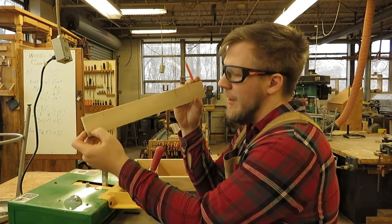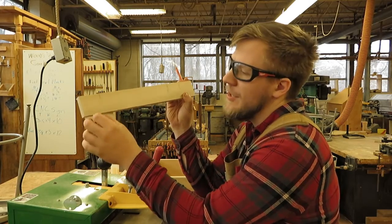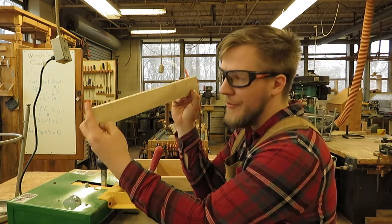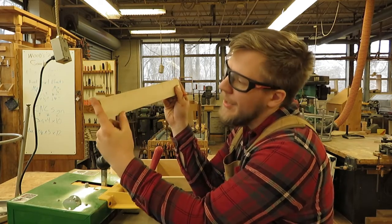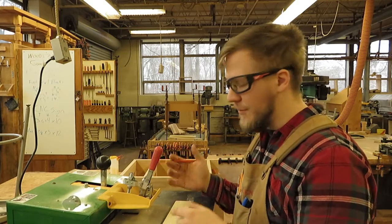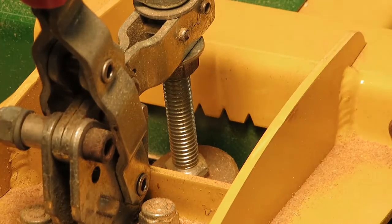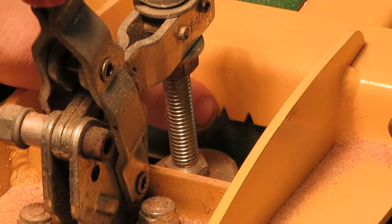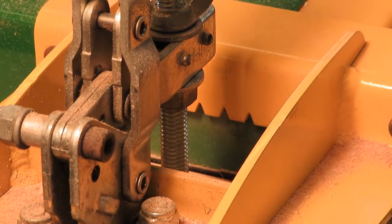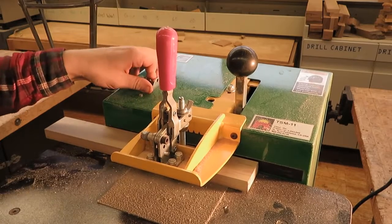For the front filler, I'm going to use pocket holes to hold it inside the case. You're going to do two pocket holes on the ends of the pieces, about a half inch up from either edge, and then from the end grain measure in two inches, then four inches for the upward pocket holes. On the pocket hole machine, I'm lining up my marks with the center cut, then clamping it down.